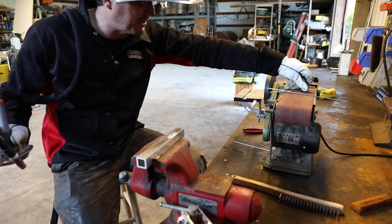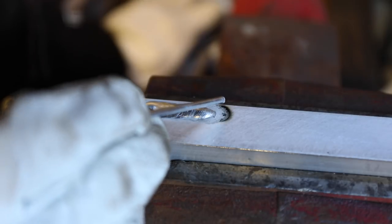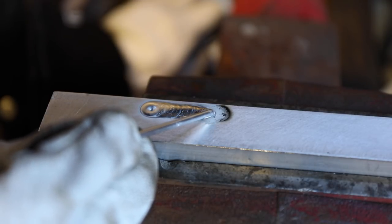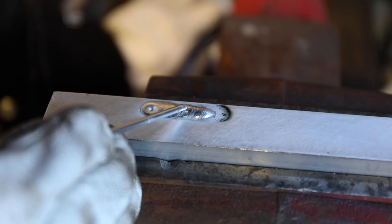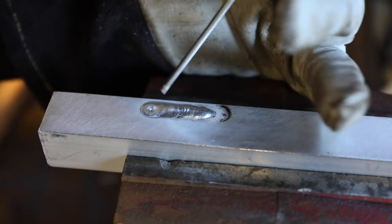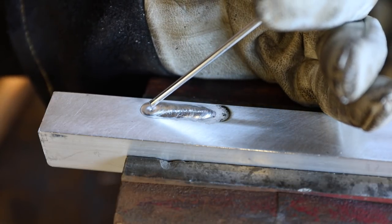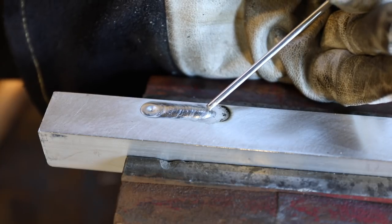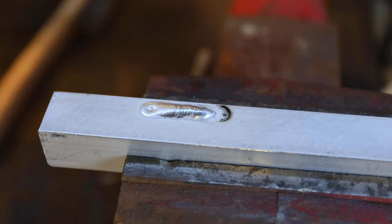Okay, let's take a look at this. I don't know what I'm looking at, but let's look at it anyway. So for my first weld, from past experience I don't want to see that black in there - I wonder if there was some contamination or maybe it's not clean enough. You can see where I started, it's sitting up there pretty high - I think I started adding filler rod before it was hot enough. Then as I went along I'm getting better penetration, but it looks like it's widening out. I wonder if I was getting sloppy with the torch angle. And then I didn't reduce the power and pull the torch away, so I actually burnt a hole in the material. Too cool here, a bad angle, then too hot at the end.